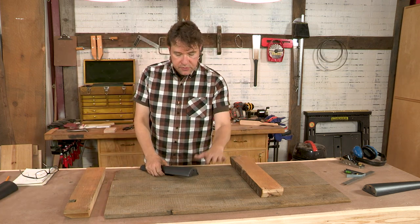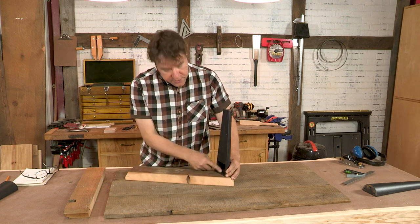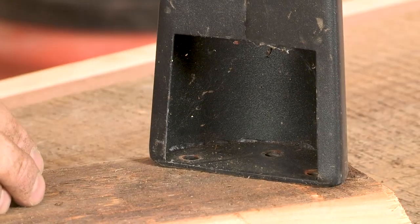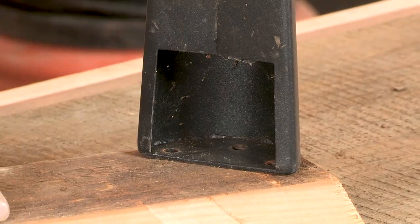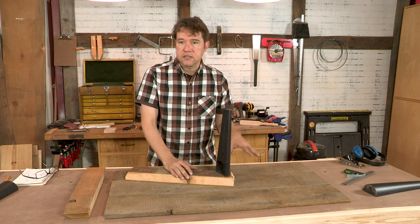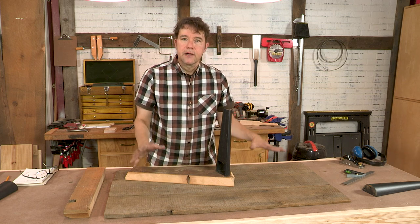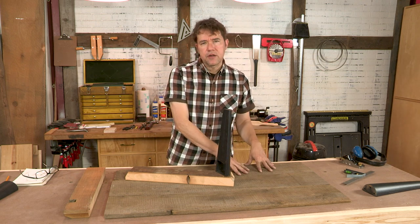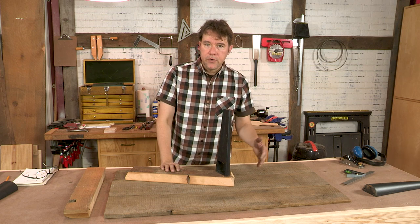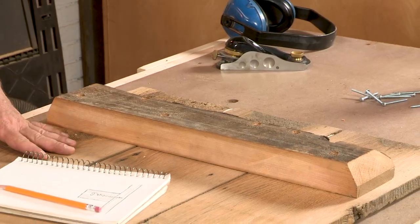The next thing will be to connect the battens to the top using screws and then connect the legs to the underside of the battens. These steel legs are easy to assemble — they have holes pre-drilled in them so we can use regular wood screws. Some other wooden or metal legs include different hardware that are also easy to install. There are also ready-made legs you can buy in stores and online, made from cast aluminum, brass, or of course wood. You can create the combination of pristine new legs and weathered reclaimed timber for the top. At this stage we're going to install the battens to the boards — the battens are reclaimed pine, jointed, cut, and chamfered at the ends.